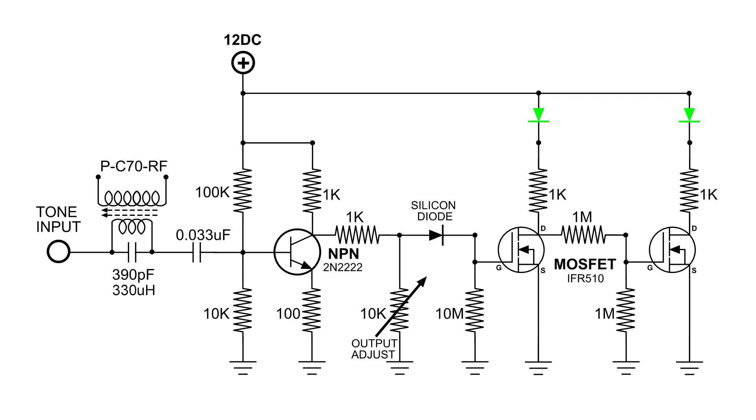The DC signal goes to the gate of the first MOSFET, and the output of the MOSFET drives the left LED. When this LED is on, it means the tank circuit is not in resonance. The output also goes through a 1 megohm resistor to the gate of the second MOSFET, which also has a 1 megohm resistor to ground. When the right LED is lit, the circuit is in resonance.